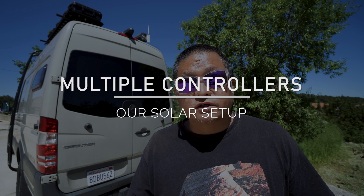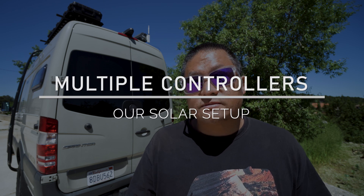The portable panels go into a separate 20-amp charge controller, also made by Victron. When selecting charge controllers, you want to make sure it can handle about 20% more than the maximum rated capacity of your solar panels. A 100-watt solar panel outputs approximately 7 to 8 amps into your battery, so with a 200-watt portable system I can expect 15 to 16 amps of maximum output on a really sunny day — making a 20-amp charge controller perfect. It may be problematic, depending on the brand of charge controller and panels you're using, to have multiple systems going into the same battery bank, as they may be using different charging technologies — for example, a PWM charger versus an MPPT charger.